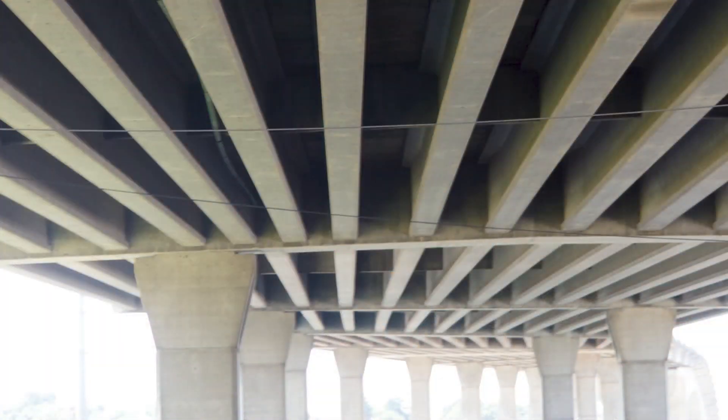So there you have it — a post-tension segmental box girder bridge. Now the construction method for the main span, which you can see up to this particular pier right here, is what we just talked about. But the approaches are actually a bit different: they are precast, pre-stressed concrete girders. You can see them behind me, and hopefully a little better in this picture here. These girders are precast away from the site, transported to the site, and lifted into place.